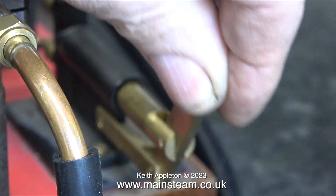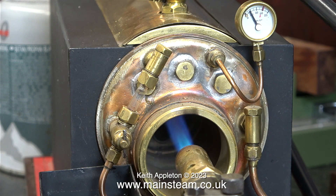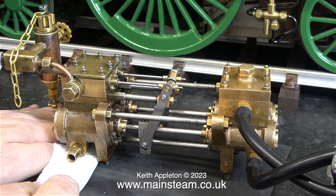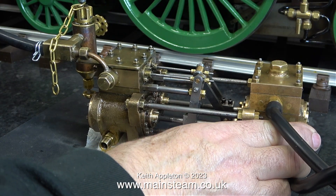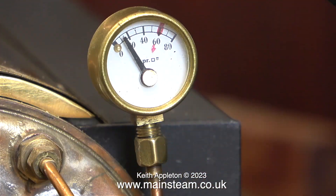Operating the pump to make sure it works is fine, but it's not a good idea when I'm trying to raise steam on a boiler with a very small burner. There's a bit of a problem with this pump - I wasn't going to mention it, but this is for the benefit of the owner. Normally steam cylinders are always fitted with some sort of a drainage system called drain cocks, drain taps, or cylinder drains. The first steam that arrives in a cylinder immediately condenses to water and this can cause hydraulic lock, which in larger engines is quite serious. It can easily blow the front cylinder cover off, but at a much higher pressure than this.